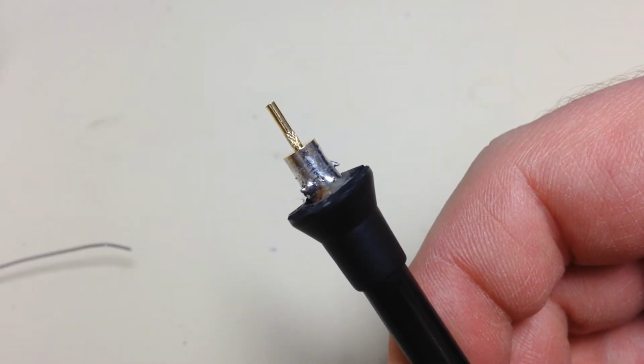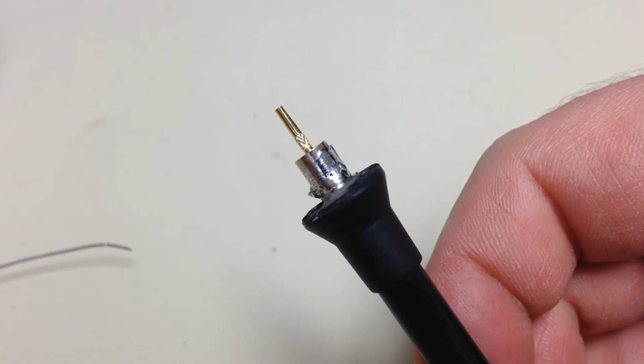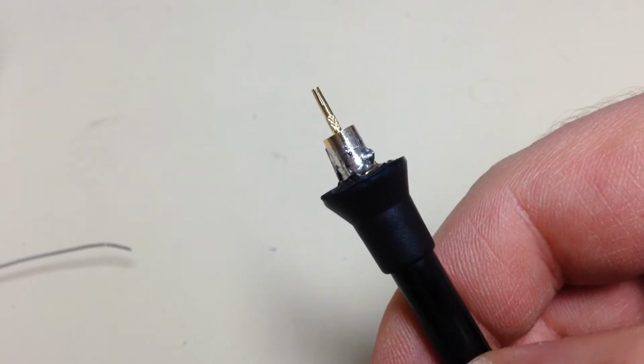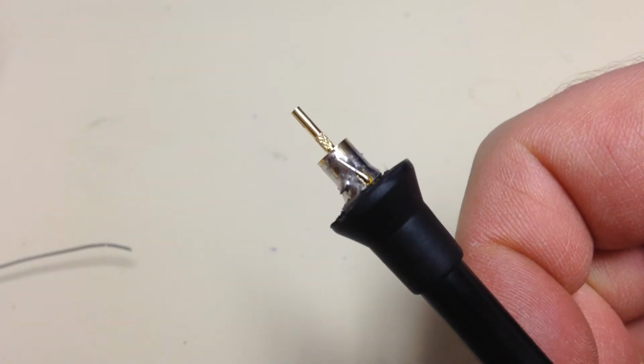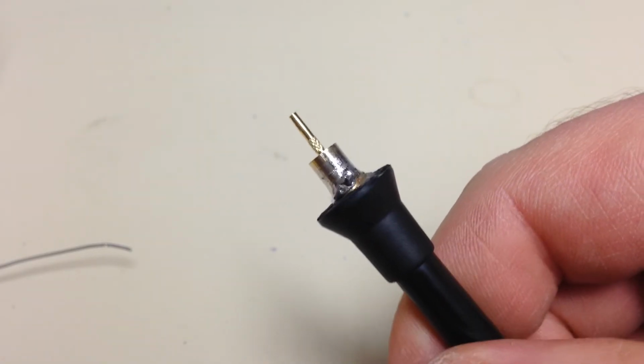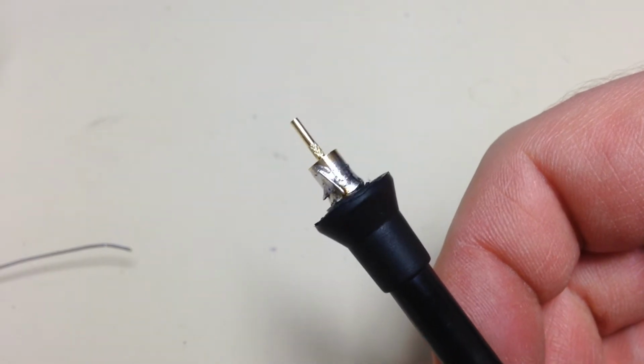All right, that's soldered on there now. I use good old-fashioned lead solder. It flows a little better, has a little bit lower melting point than the normal silver solder I'll use, but clean that joint up and that's looking pretty good. It's nice and straight. The two ends of the pieces are flush together.